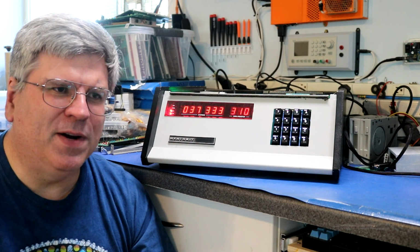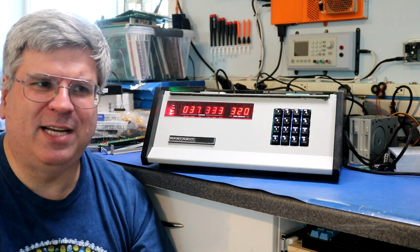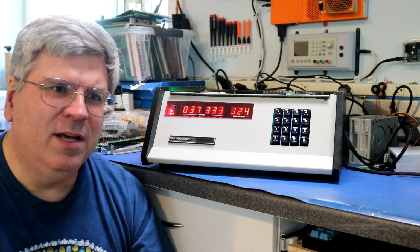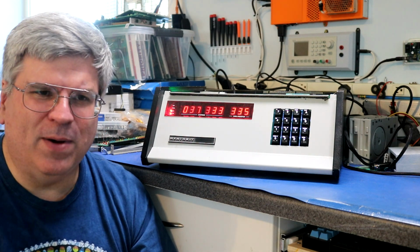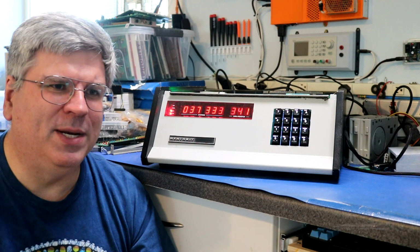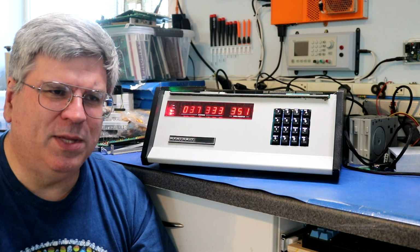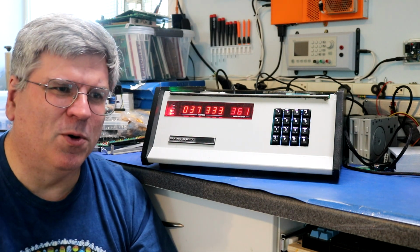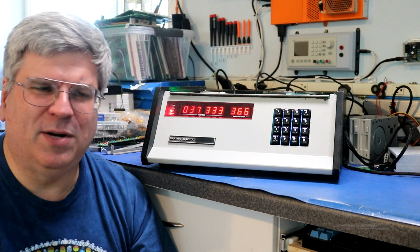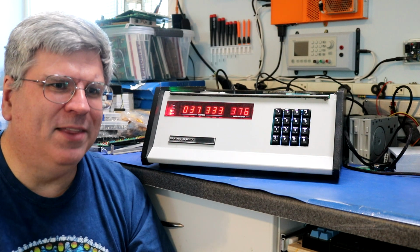Now, people have produced various upgrades for this computer. For example, in one of my recent videos, I designed an 8085 CPU board for it, the 8085 supporting a little bit higher clock rate than the 8080 and being a little bit newer microprocessor. Other people produced boards with a Z80. I even came along and did a Z8000 16-bit board at one point, just for fun and to try something obscure. But I wanted to explore, what if we go in the other direction?